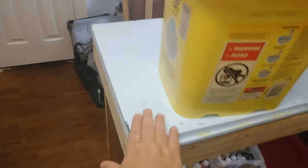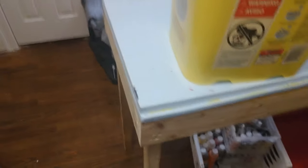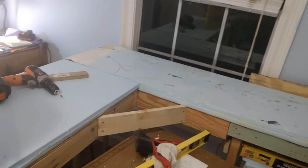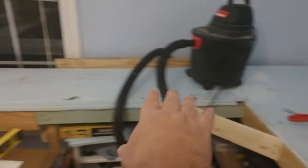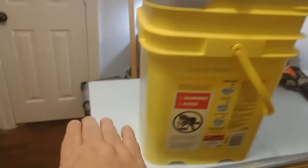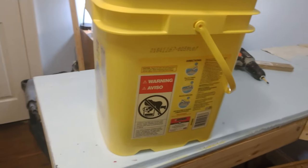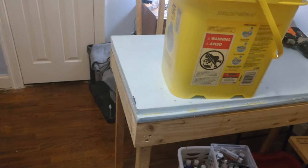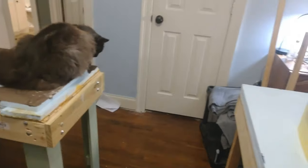When I got over to this section I had a lot of room there, so I had to actually redo those legs — just cut a little off them, put the levelers back on, and get it all level. What had happened was this whole area was running uphill, just a little bit, until it got way over here — a good ten or eleven feet distance — and it was about half to three-quarters of an inch higher than I needed. So now this end and the far end where Raven is sitting are basically the same level.